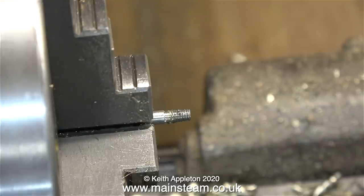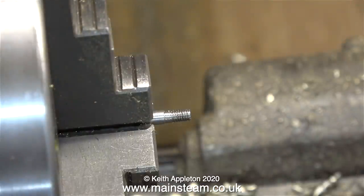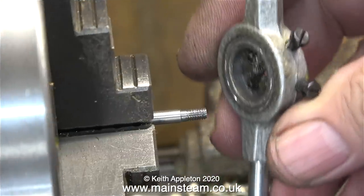In my career I really did spend a lot of time playing music from rock and roll to jazz. Here's the thread, but there is a problem — I've exaggerated this on purpose for the video. When you thread up to a shoulder with a die, because the leading edge of the die is tapered, you can't get all the way up to the shoulder.